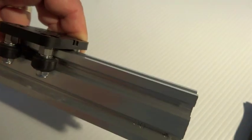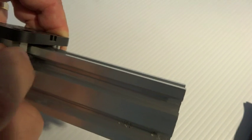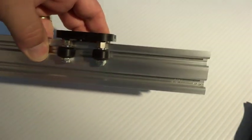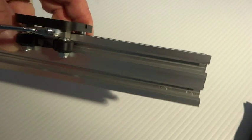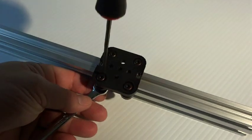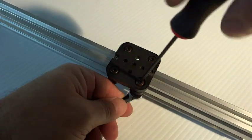Be careful not to over-tighten — as soon as you start to feel it grab, you're close. Move just a sixteenth at a time when you get close; you can feel it spinning out a little bit. Once you get this set you shouldn't have to mess with it again, but you can always adjust later. One last step: put the wrench under and give the standard wheel nuts a little quarter turn to make sure they're snugged up.